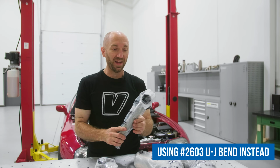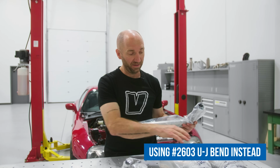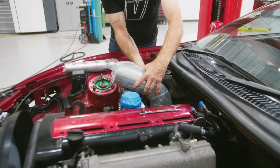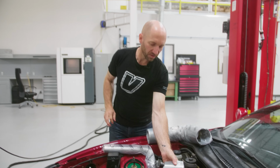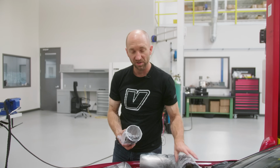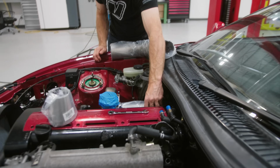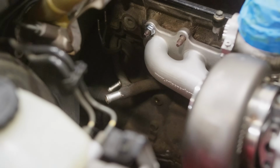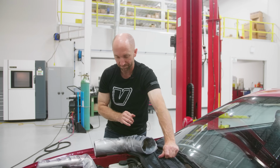And then I also need to add a 1.75-inch tube for the wastegate dump tube to recirculate back into that 4-inch downpipe. If we did initially go with the 4-inch, that is a lot of downpipe to fit in there. Doesn't really fit that well with the transition cone because this piece is going to go right basically on here. If I shorten that, use a smaller 3.5-inch tube, and then I also still need to have room for this 1.75-inch to go down beside it as well. I did already modify this water pipe down here. I've capped it off. That barb's been relocated to the other side. It'll shorten that line and clear up a little more space for our downpipe.